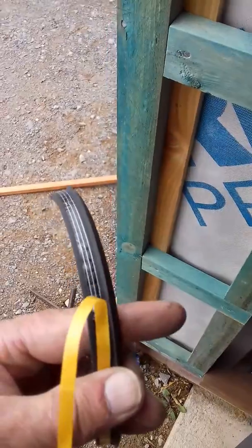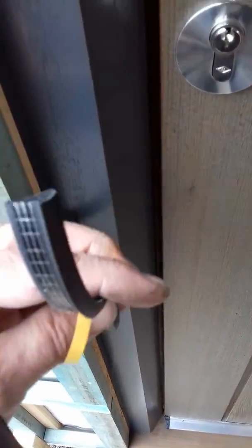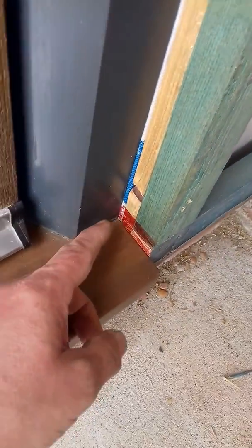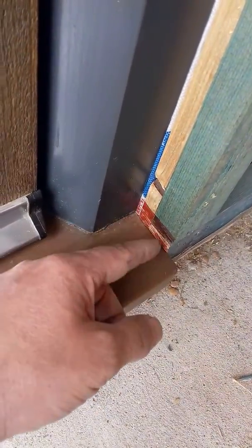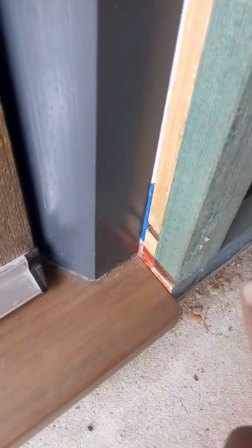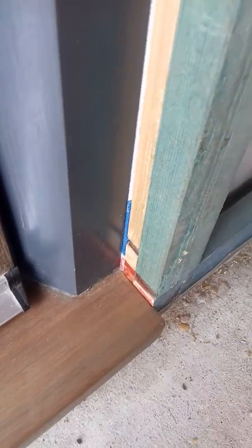We've painted this grey, you don't have to. There's the EPDM edge seal, that's a compression seal on the back. Quite a simple little product. Self-adhesive, pull the tape off, line it up with the lip on the front, and then that goes on there. When you're fitting it, at the bottom, once again, here we go with the colours. Big bead of sealant, up 7mm, and then it's compressed that way, so the seal is actually in compression.